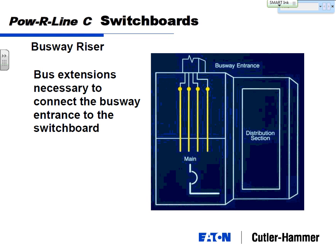Now, one other thing on switchboards, I don't think you guys have talked about busway yet. Next project, usually, bringing bus to the panel. But everything in the panelboard and switchboard discussions so far has been about cables feeding from the utility or cables feeding out of the switchboard to a load. If you use a switchboard, you do have the option to connect busway.